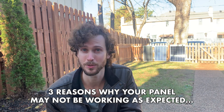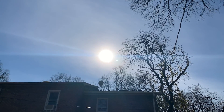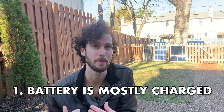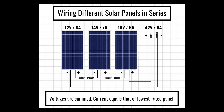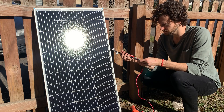But what if you test your solar panel and you measure a voltage, current, or wattage that is way less than expected? Please double-triple-check the basics: make sure your panel has no shade on it at all, make sure there aren't any clouds in the sky — even thin cloud coverage can reduce a panel's output — and make sure your panel is clean. If your panel is connected to your system, it might have abnormally low output because your battery is mostly charged, and the charge controller might be throttling the power it's pulling from the panel. You can test this by turning on a load, draining your battery a bit, and seeing how your panel's output responds. Also, your solar array might be wired together in a way that's reducing your panel's output — disconnect your panel from any other panels so you're only testing one panel at a time.